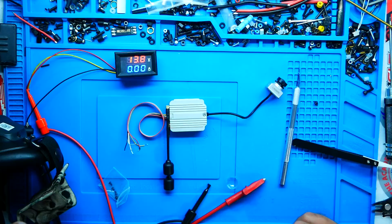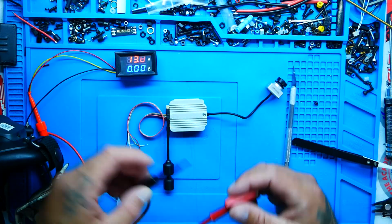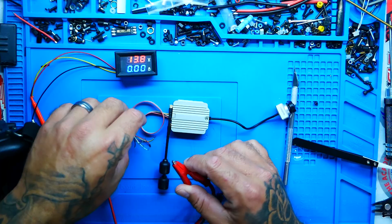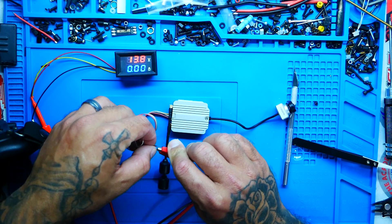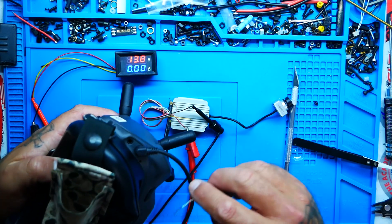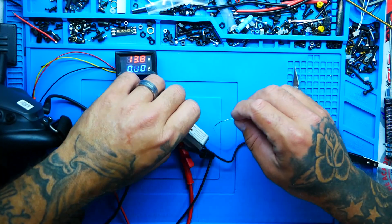The voltage range on the DJI Air Unit and the Caddx Air Unit is 7.4 to 17.6 volts. I've connected a meter wired to the same wires. I'm going to take this to power it up — grabbing power with power and ground with ground, making sure we don't touch anything else. Now I need my trusty paper clip. We are going to press the button on the Air Unit and press the button on the goggles — there's a little red button right there. Press, flip, press. That is it. It is that easy. I've never had a problem, it's never not bound. It's absolutely amazing.